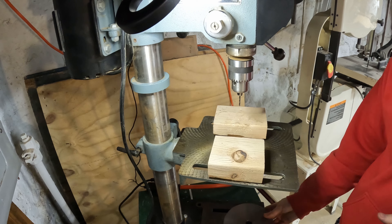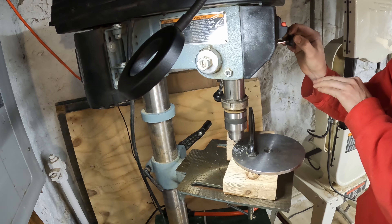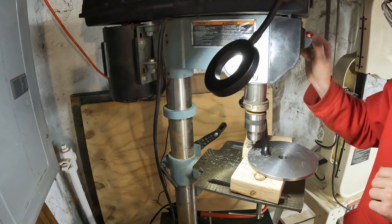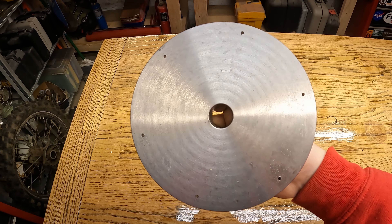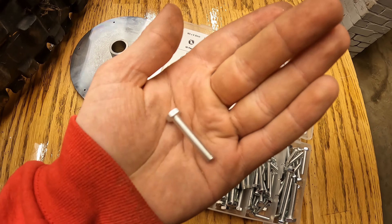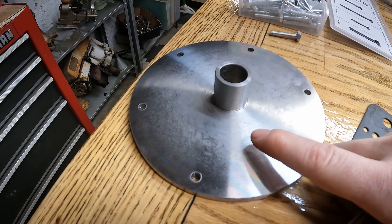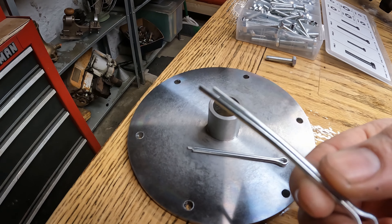I set these two hunks of two-by-four here to accommodate for this hub on the bottom. Before I drill these holes any bigger, I need to figure out what size bolts held the calipers on that wheel. Harbor Freight saves the day — M6 by one. Looks like 15/64 is our answer, but I don't have metric drill bits. I need something to lock that three-quarter axle through this hub, so I think I'm just going to try out these cotter pins first. Can't go smaller, so.